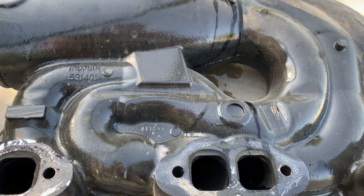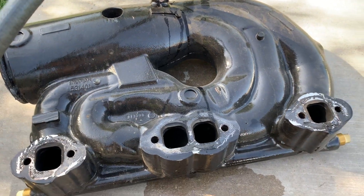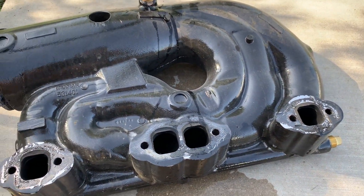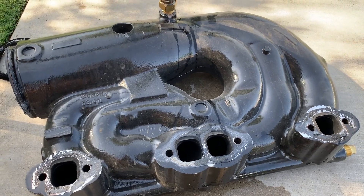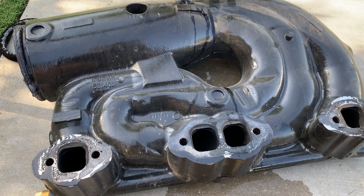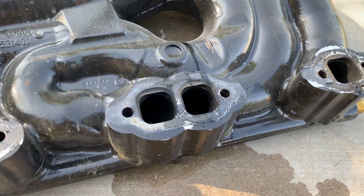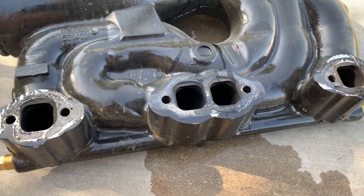Indmar has a new rerouting system that you need to put on your boat if you don't already have it. What happens is, you turn the boat on for the first time and hot exhaust is flowing through these manifolds without water getting to them, because water doesn't get to them until the thermostat opens. You may have heard that you never put cold water on hot aluminum because it'll crack it — same thing happens here. I think these things get so hot, and then when the cold water comes rushing in a few minutes later, it just fractures the inside, hairline cracks them, and eventually they just break.